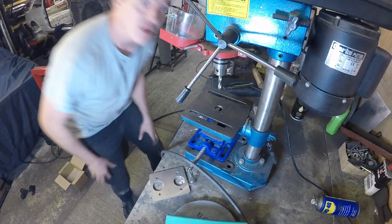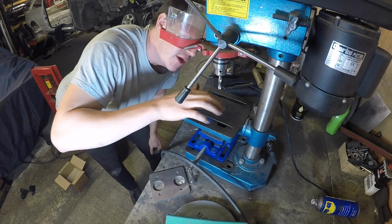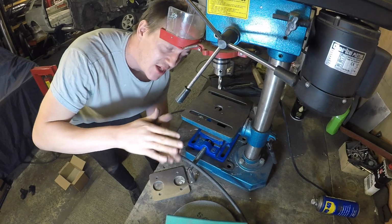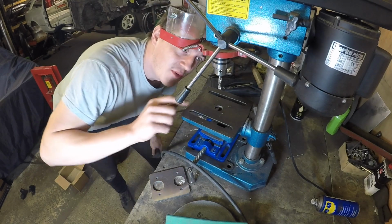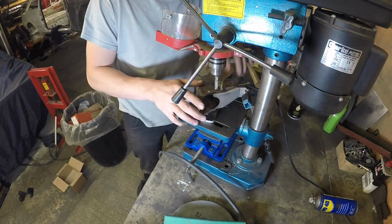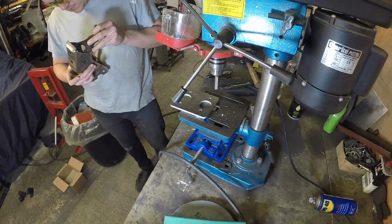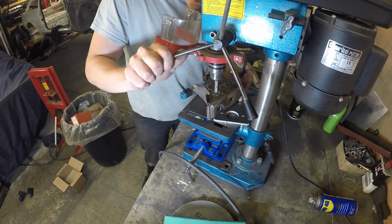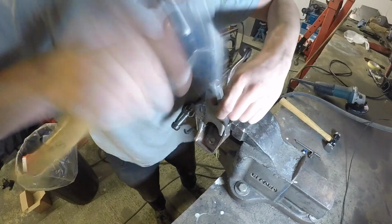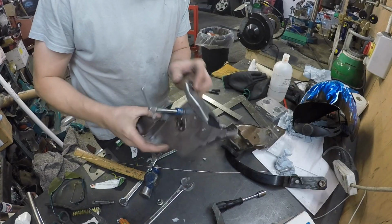It's just spot welded. For people who have never used them, this is a spot weld drill. So the bottom of it's kind of flat with a little point, and the idea is if you've got 2 sheets of metal with a spot weld through it, you just drill through the first sheet and then the other one comes away. In practice what happens is you end up drilling a massive hole through both sheets. Unbelievable. We're in position.